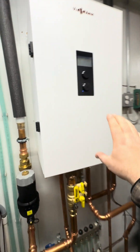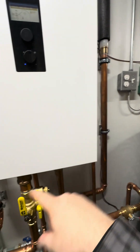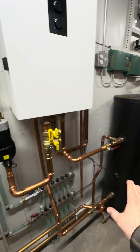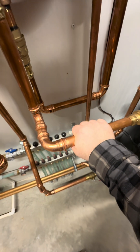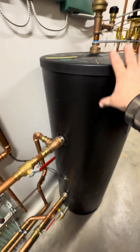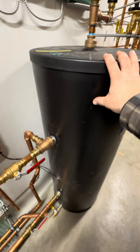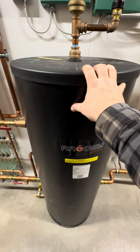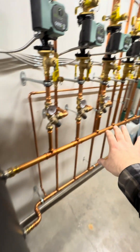Out of the unit, we've got the supply and returns here. They go through the diverter valve, which tells the water where to go. It's heating right now — it's quite hot, feels awesome. It's going into this buffer tank, charging this buffer tank, which the gas boiler is also connected to. This is a plastic 40-gallon buffer tank.